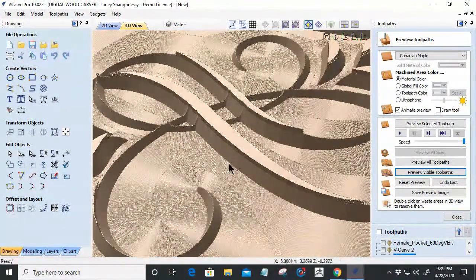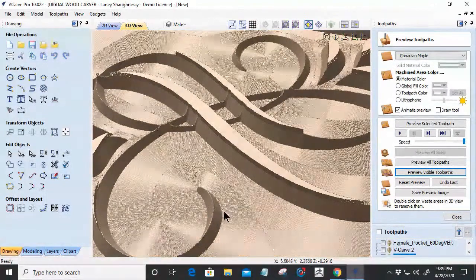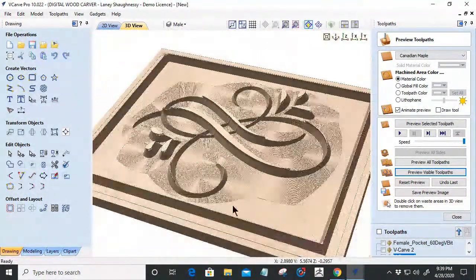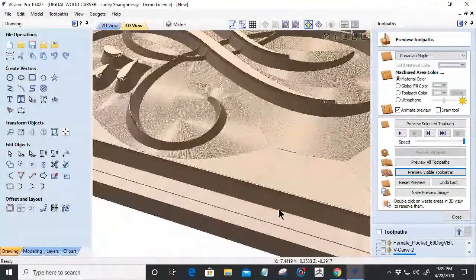So we need that nice cone shape. So we need to make sure that we don't exceed our cutting depth of our cutter, or that inlay is not going to happen. Even on the outside edge here, if we were to closely examine the outside edge,